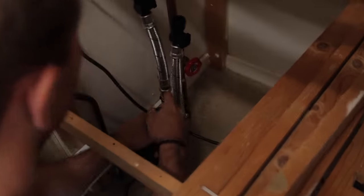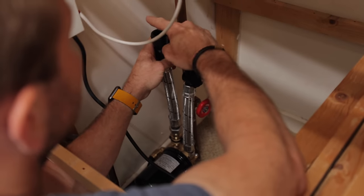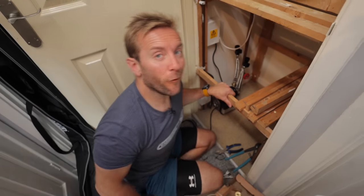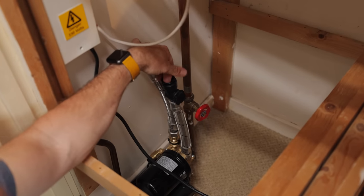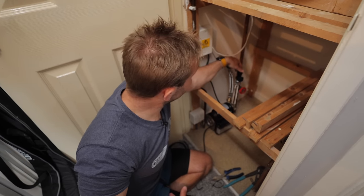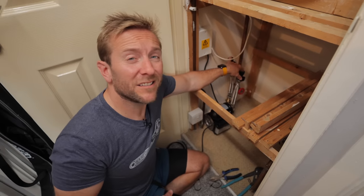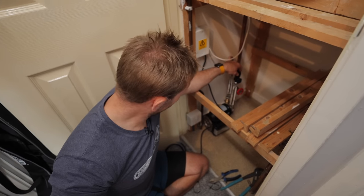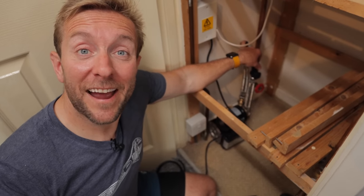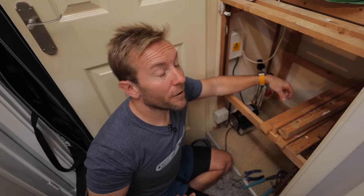Our outlet's going to go like that and down, and this is going to go in there, so we'll have to put a little bit of a set on this pipe. Quick multiple choice for you: with the pipe like this, what problem do we have? Is it A — our pipework we want to cut into is above the valve and therefore live? Is it B — the two flexis are at different heights? Or is it C — the fact that I haven't been offered a coffee in the last 35 minutes? If you said A, you were correct.